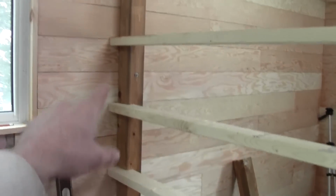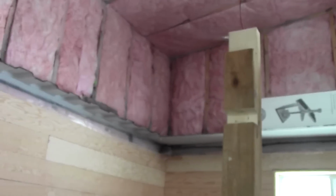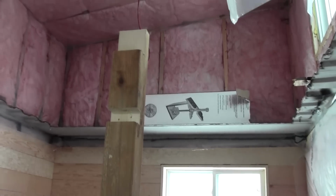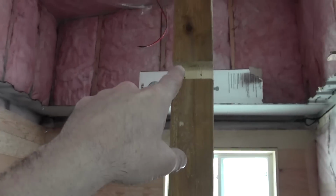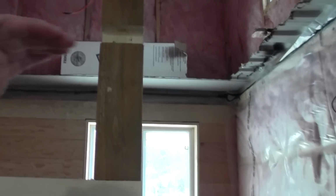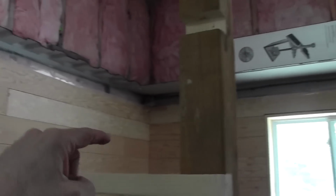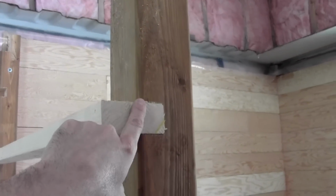So how I fixed my issue with cutting my 4x4s the wrong way, because I kind of wanted a 4x4 across the top instead of 2x4s, aesthetically and also structurally. These cuts were actually supposed to face in, was the original plan, and then these 2x4s would slide into it like a dovetail type thing. But what I've done instead is I've turned it, I made them a little bit deeper, and I put my 2x4 right into that. So I think that's 1.5 inches in.